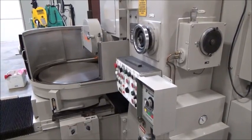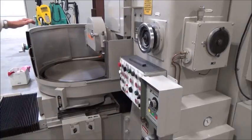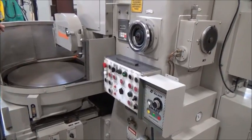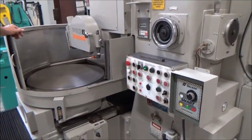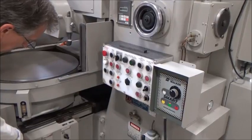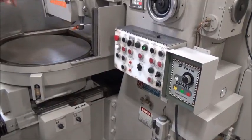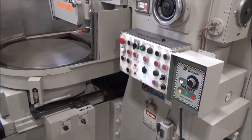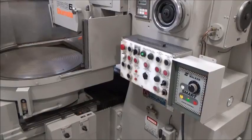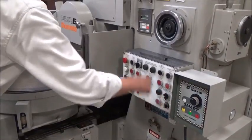We're moving up on zero. This light shuts off when it starts counting spark out passes. There it is — it just shut off. I think it skips the first one so you can always get at least one pass. It'll start counting after this. And there's our spark out — going home. That's that. It just reset itself to zero.